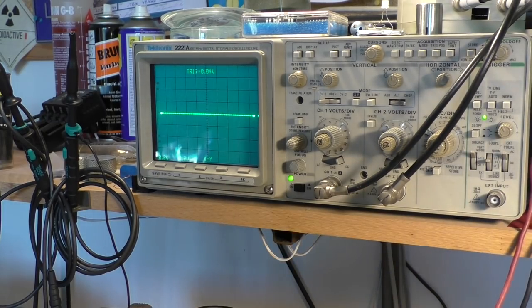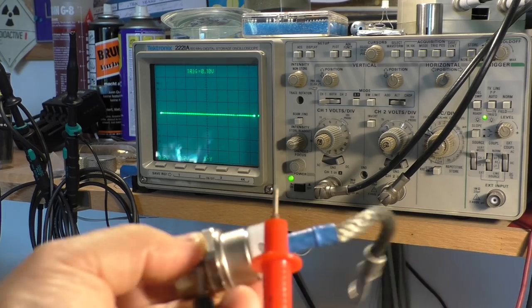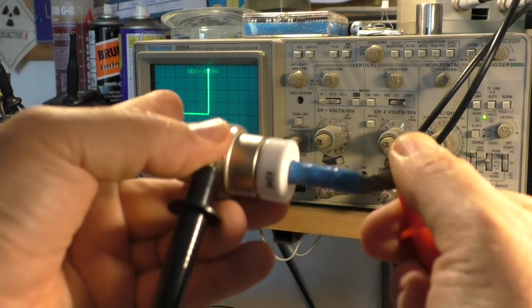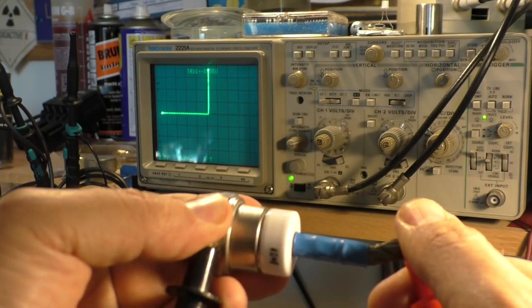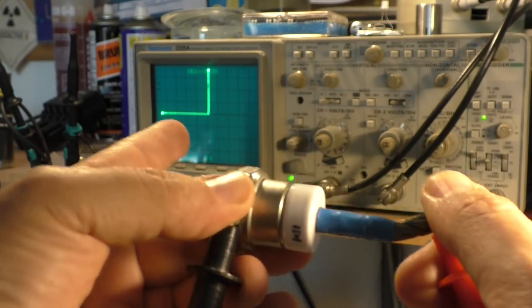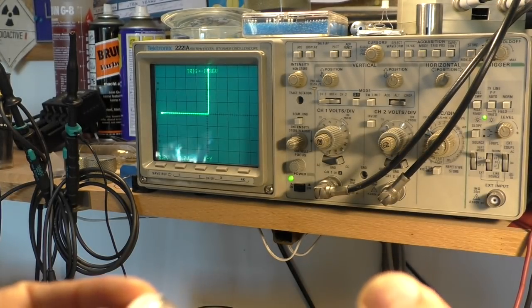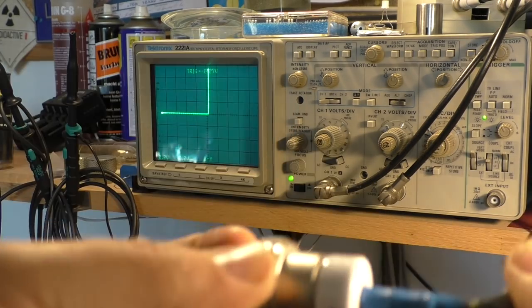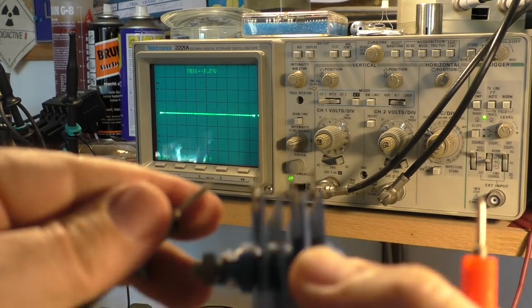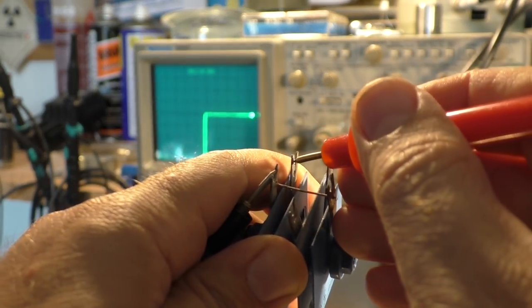and if I connect a diode like that, well, I set minus is here, positive is here, we get a diode signature here on the oscilloscope. You see in reverse direction, which is here, it doesn't conduct, there is no current, and then in forward direction, because we are testing with AC, we get a high current but no voltage, so probably 0.6 volt maybe for this big diode, a little bit more. Let's see what the selenium rectifier does. So I take the minus, that's the one with the connection here, and go here.